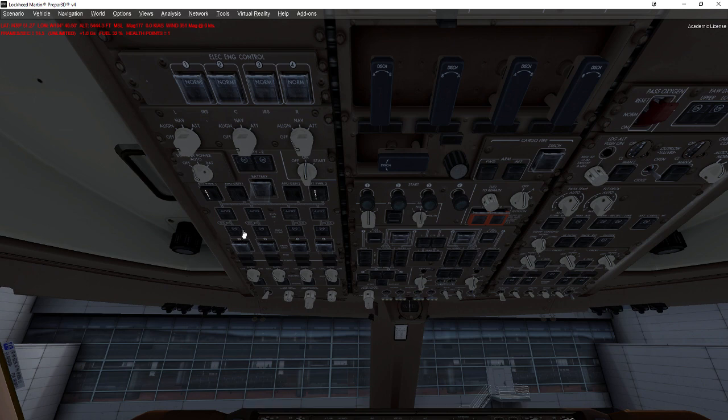When the avail lights come on, we can push the switches to select APU power. We'll turn the nav lights on to signal to the ground crew that the aircraft is powered up. Now we'll set all the IRS selectors to nav.